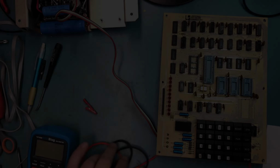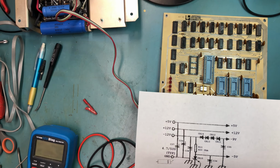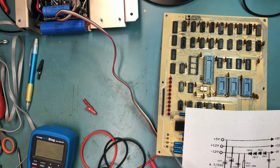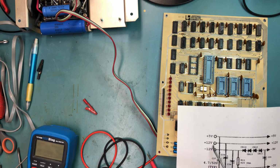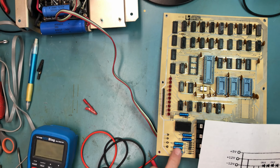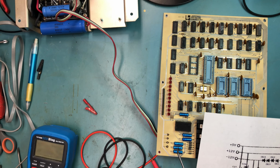So I took a look at the schematic, and I grabbed the power supply section out and pasted it in here, and then I cleaned up the labels on things just so it would make more sense. And we've got the 3 incoming voltage rails here, +5, -12, and +12, which is these. We've got a ground connection coming in. We've got 3 capacitors that are right here, that are directly across the +5, the +12, and the -12, although I think, well, it's +5, -12, +12. That's why the polarity of this one is different.